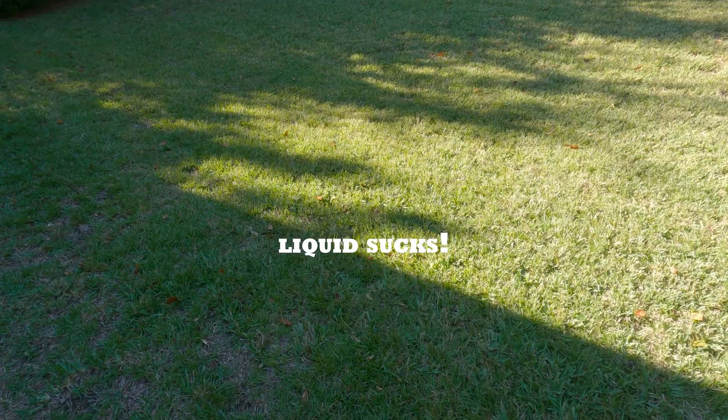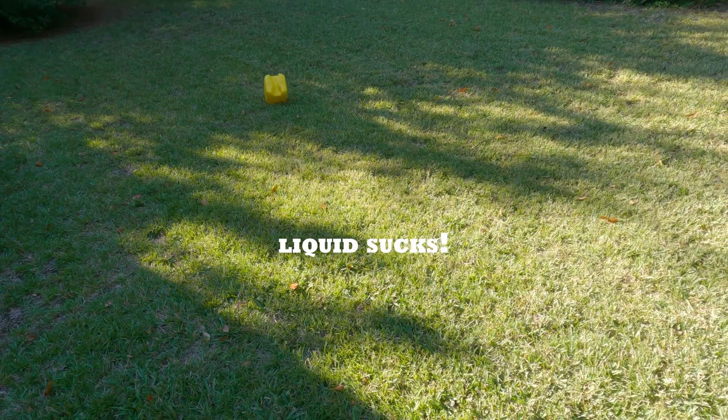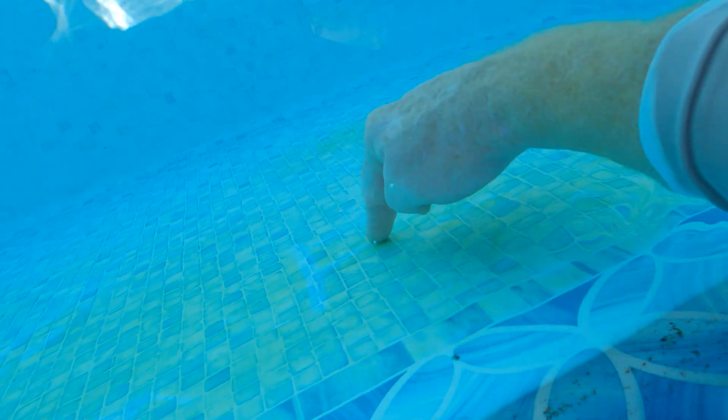As promised, here are my own personal preferences and how I run all of my pools. First, I never use liquid chlorine — it's just too messy, too bulky, and the pH is too high. I cycle back and forth between cal hypo and tablets. I only use about three tablets per week in a regular 20,000-gallon pool — two for a smaller pool, four or five for a larger one. The point is I'm not filling the chlorinator all the way to the top. I use cal hypo for any quick adjustments or shocking needed to get rid of algae or the funk from a pool party.